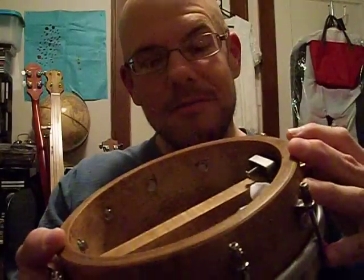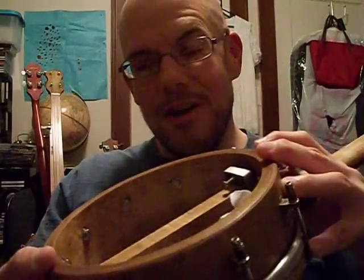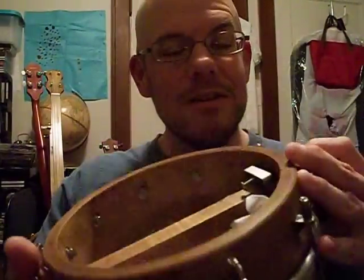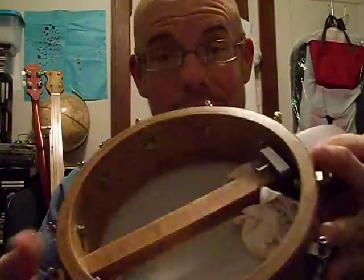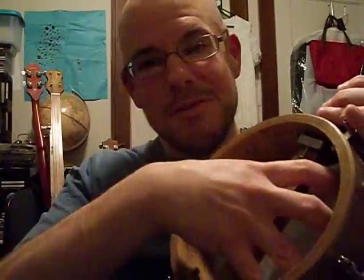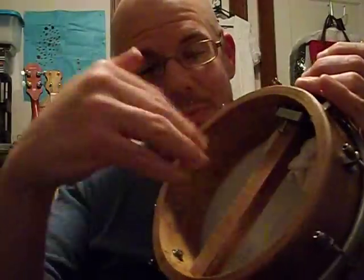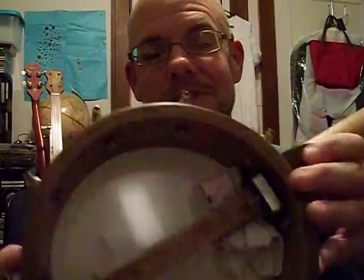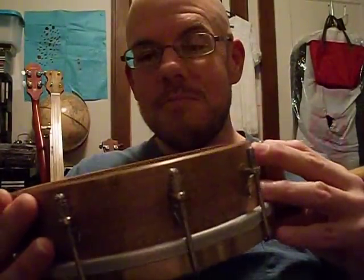You put it together dry, measure all the pieces, take them out, and keep them in order. Then you take each piece and smear it with epoxy, put it back in this form, put that piece inside, and stick wedges in there, which pushes it out against that steel form on the outside. It makes you a nice laminated shell. And it's turned out real good.